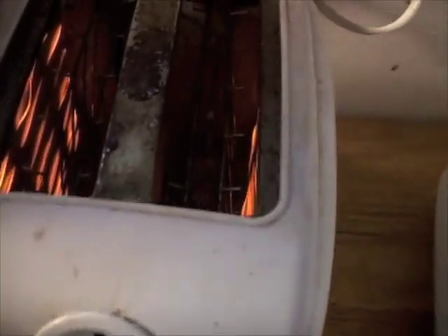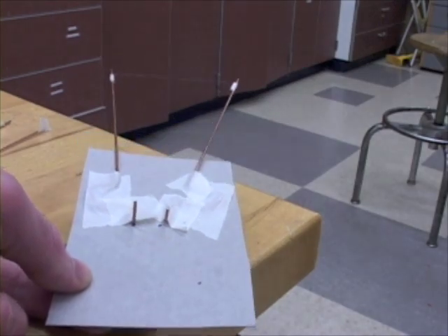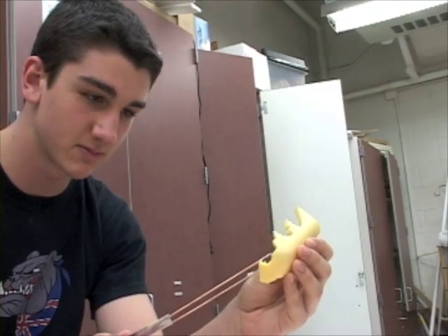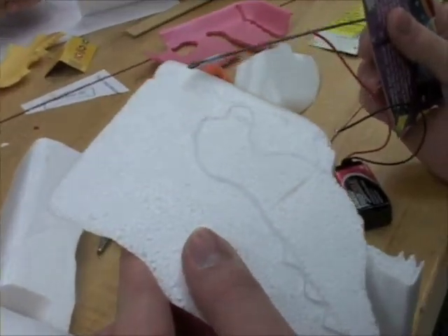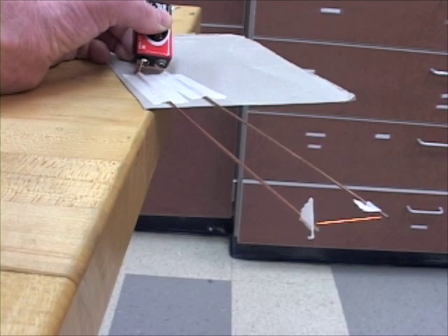If you use more flexible conductors than forks — these are thin welding filler rods — you keep the wire under some spring tension. When you keep the wire long, it stays safe and it doesn't make irritating smoke. If you shorten the wire, it'll get much hotter. I don't recommend it, and the wire won't last long.